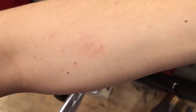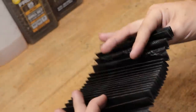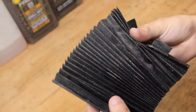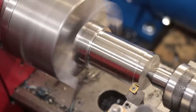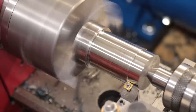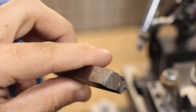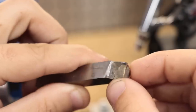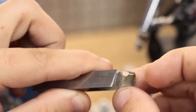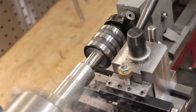And that's something you really don't want landing on your skin. Not only that, but the heat of the chips has also melted my way cover, which isn't exactly helpful. My cutting tools are also suffering a little bit. I know the carbide can handle the heat, but I know it isn't performing as well as it should be, and I've managed to burn up a few high-speed steel cutters. I have been manually applying coolant and cutting paste, but there are better ways of doing it.